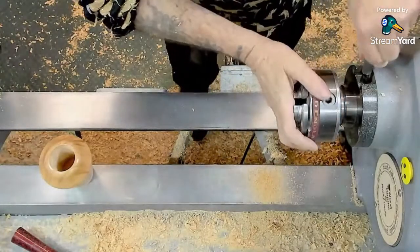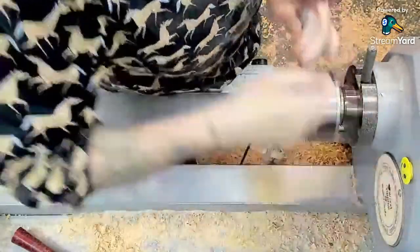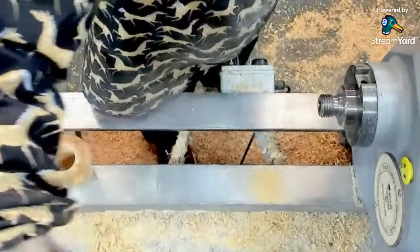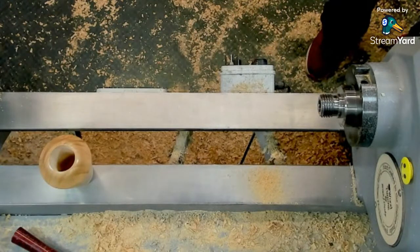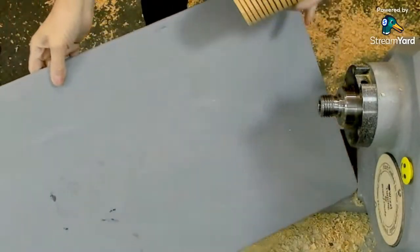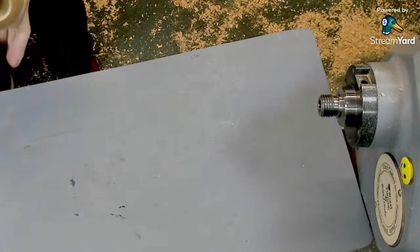Brian with a Y was saying when you part off metal, the parting tool is ground with an angle to cut the part off leaving a nub on the waste. I often wondered if it was worth trying on wood. Yep. Try it, because it tends to break out as you get running close. It does, particularly on softer woods. It's a bit of a tragedy, to be honest. If you're trying to get a piece that's kind of perfect, it makes a bit of a mockery of the whole thing when you have a hole in the bottom.